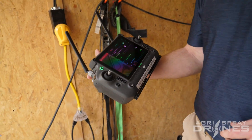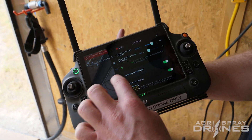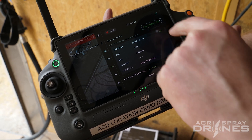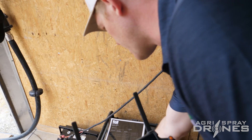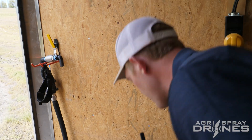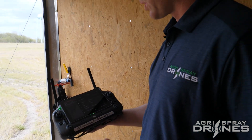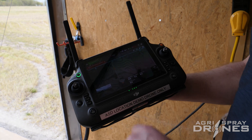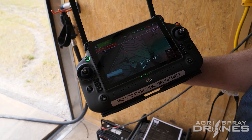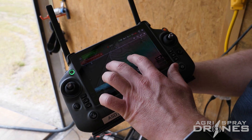Then we will map and fly the T40. So right here is our regular satellite imagery. We're going to go into settings, go into RTK, and right there we've selected from the drop-down: custom RTK network. We just put in all the Digifarm information — everybody gets this when they get Digifarm. We are a dealer for Digifarm, so contact us for more information. As soon as you connect, right there, we have RTK. It's just pulling off of Digifarm's base station and cellular network. Super simple.